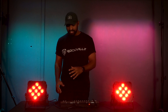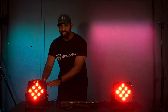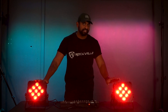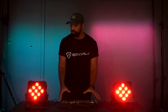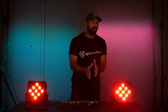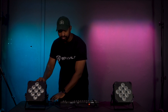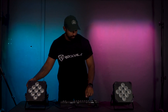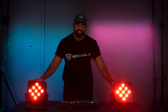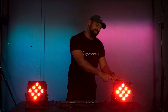What's really cool is if you're using wireless lights like the FEST PAR 60s — even though I'm connected through a wired cable on this light, it's actually transmitting the signal wirelessly to my second light. So you would just need a DMX cable going from your DMX controller into your first light, and the rest of it will be a wireless connection. I only have a wired physical connection from my Rockforce W2 into this first FEST PAR 60, but when I adjust it, both lights change because the signal is being transmitted wirelessly from this light to the second.